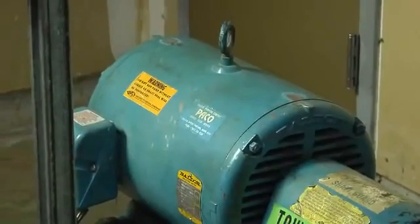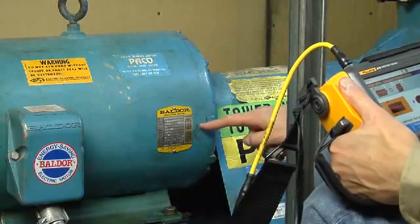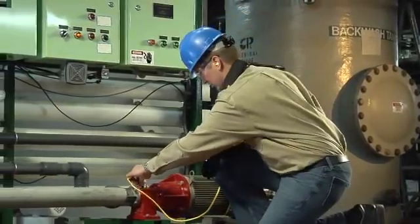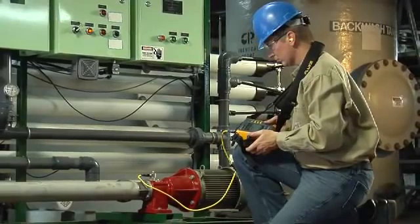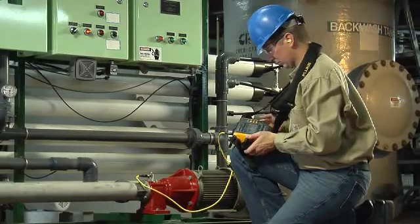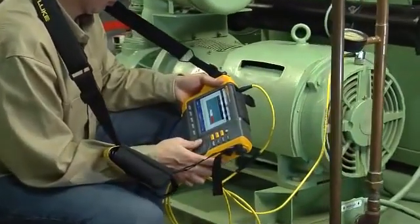From these marked locations, you can place the sensor either at the top, bottom, side, or end. Take vibration measurements when the machine is running at a steady state and at normal operating temperature. All of the measurements must be completed within 30 minutes to minimize the risk of varying load conditions affecting the diagnosis.